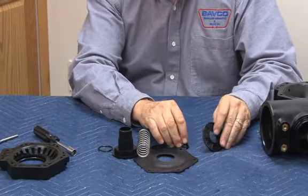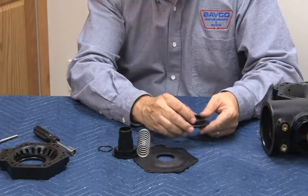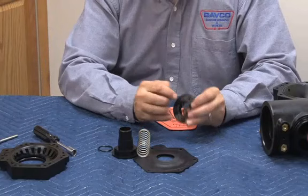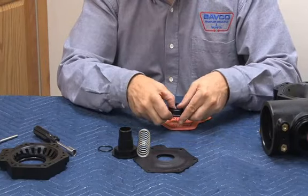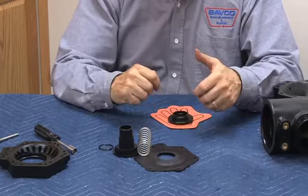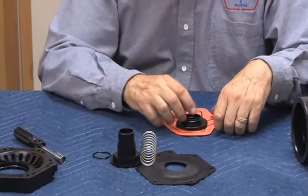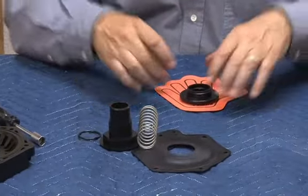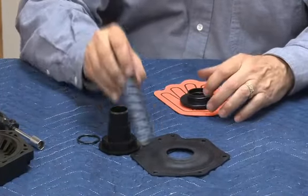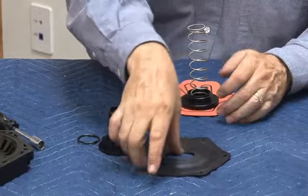The assembly is going to be just the reverse. There's no rubber parts here because that's our seat, as I mentioned. Remember this is our relief valve seat, so we're going to have to reassemble this. We have to place this in a down fashion. Obviously, we don't want to stick this on something dirty or that could nick that seat. So you want to have something soft, clothish. A little bit of rubber is good so it holds it in place so it grips when you put it back together. Relief valve spring.